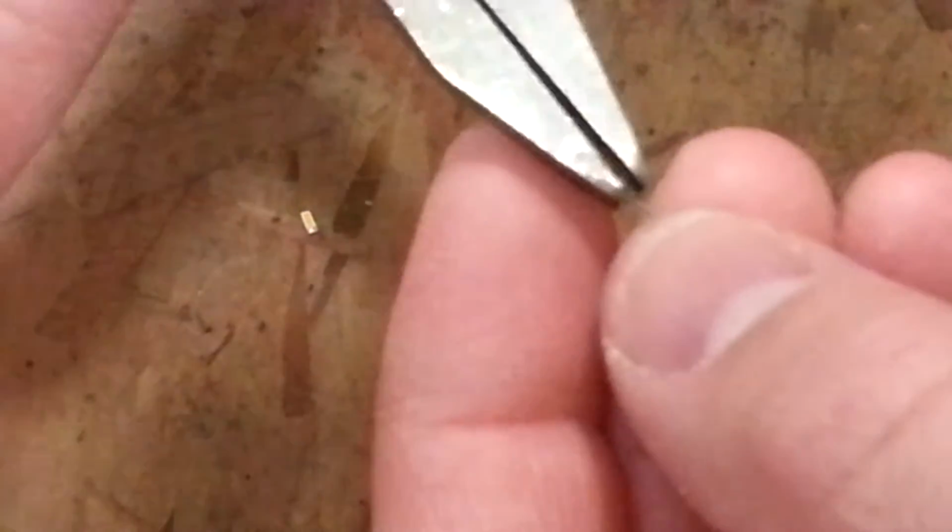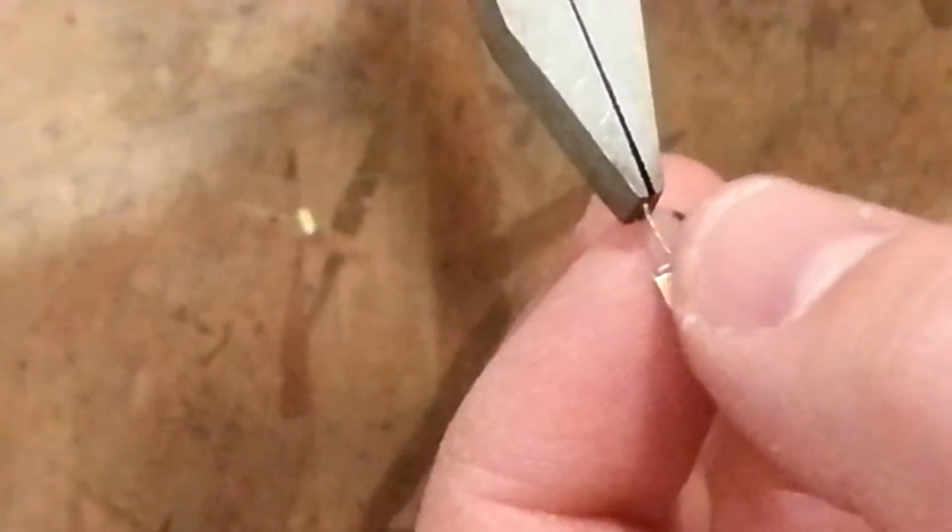The trouble is, and you'll notice here in a second, that when I solder that first one to the second one, because this is the middle one, it's going to want to release the first solder joint. And so I have to be very careful to get this job done as quick as possible. That's why I tinned everything first. Now these don't need to be lined up in that contour, but the closer you can get it, the better.